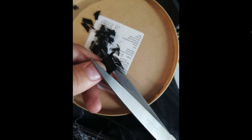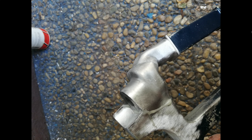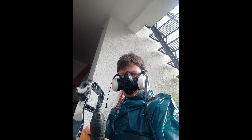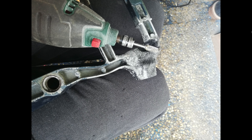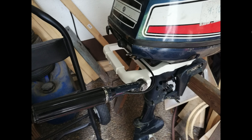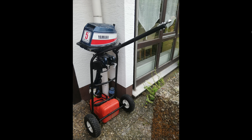For the arm, I cut some leftover carbon fiber I had laying around, mixed up some epoxy, glued the arm together, and put some epoxy with the fibers on it. I put it in the oven for a while — you don't want to breathe in that stuff. After a little bit of cleaning, sanding, and spraying I also made new rubber dishes for the arm. Now you see everything together: rubber dishes with the arm and the repaired arm holder.